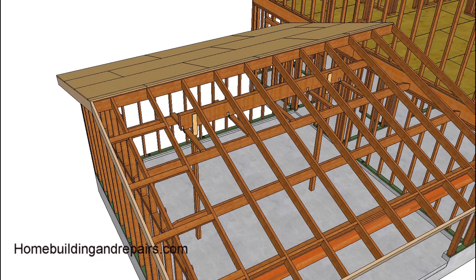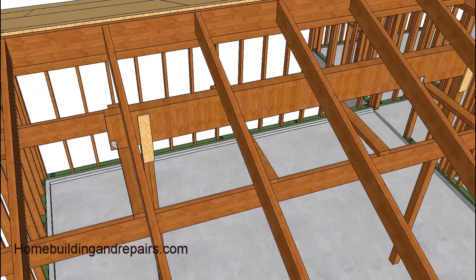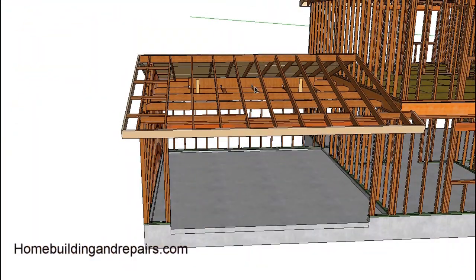For the most part the heads were off of them, not all the parts were on. If you're going to be lifting a tractor, you might want a 6x16, and you might need to run it across, double up some of the garage ties or rafter ties to support the weight of the beam. Tie it to where the beam isn't moving. These boards can run all the way across to the other rafter ties, ceiling joists. When you're done, get rid of the posts, leave the beam in the attic, and it's ready for next time.